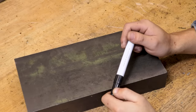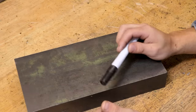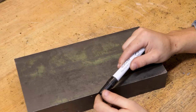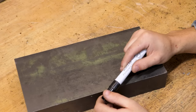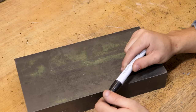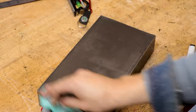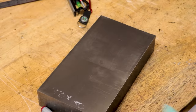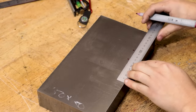And that brings us to now. What I'm going to do is make one of those two-piece split vises. It should allow me the flexibility to clamp large pieces of work to the table, and that should, if everything goes to plan, allow me to face it in one operation. In order to make it, I have a spare piece of 50 mil thick 10-20 grade steel, and what I'll do is I'll mark it up and get a few pieces cut out.